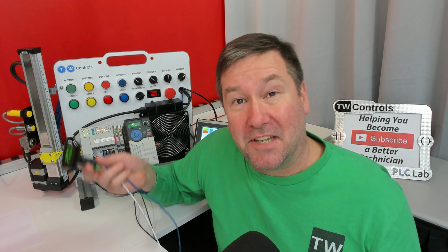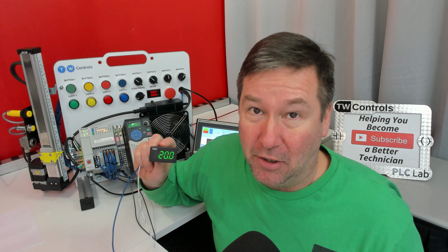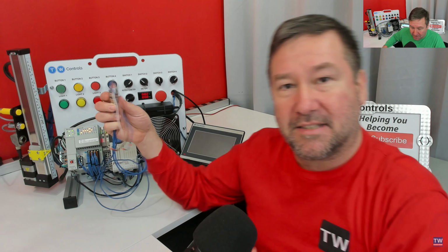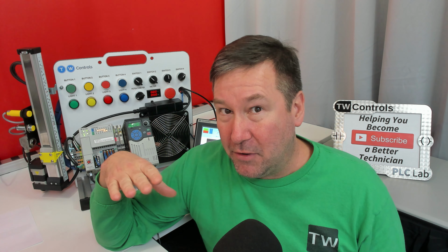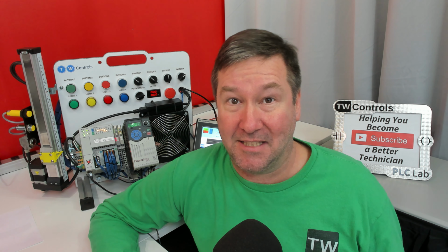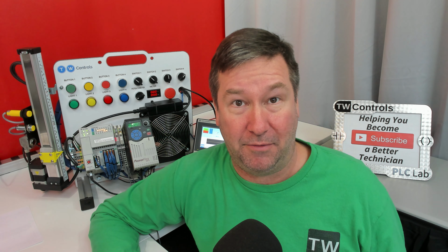Today we're going to continue our discussion on how not to measure a 4 to 20 milliamp signal. In the last video, when I was trying to explain what not to do, I accidentally did what I was not supposed to do. I thought it made an excellent real world example, so I just went with it. But several of you have messaged me since, where I was talking about current limiting, and said, well, my PLC input has a resistor in it, so I can short out the plus and minus 24 volt.